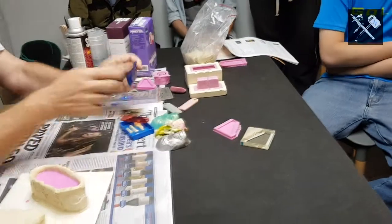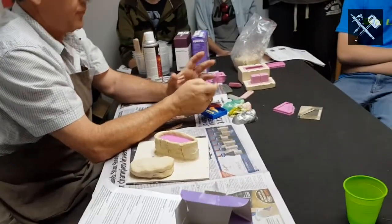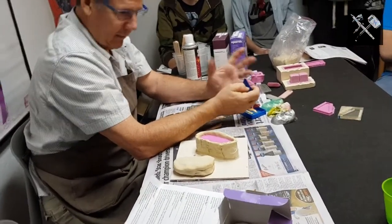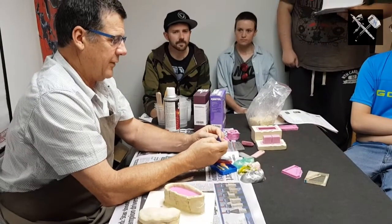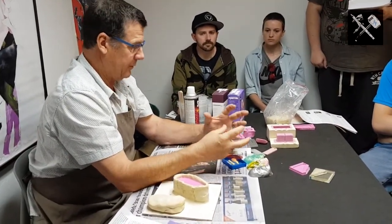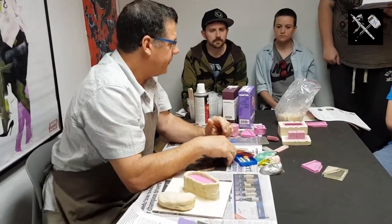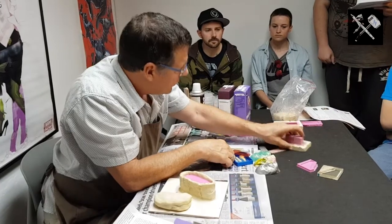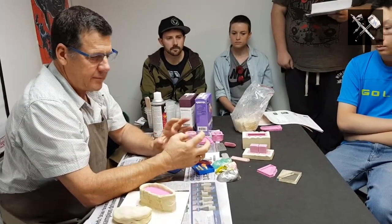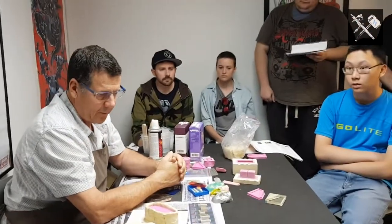Okay. In the case of most of what you people are doing, it's a 2-piece, maybe even a 3-piece mould. So it's starting to get a little more, not difficult, but you've got to put some thought into your moulds and how the 2 pieces or 3 pieces are going to come apart, how they lock together. I'll show you that once we do it. So yeah, it's a bit like a jigsaw puzzle, and working out how that jigsaw puzzle is going to pull apart.